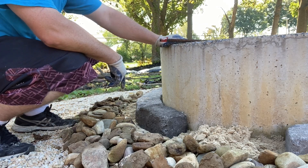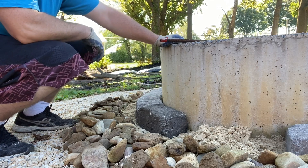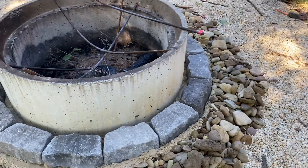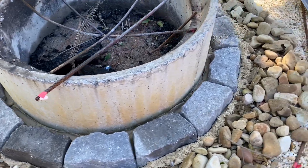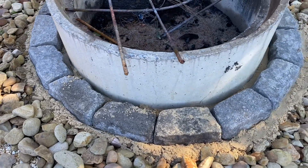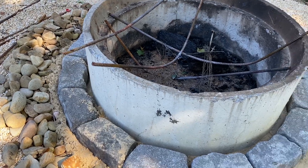Let me go ahead and finish this row and then we'll start on the second course. Everything is nice and level. You can also measure from the top block up to the rim just to make sure you're even all the way around — if you followed your reference line in the first course, you should be fine already, but it never hurts to double-check. First course is all done. When I initially measured, I needed a little more space, so I just moved the block slightly away from the concrete and it allowed everything to fit in perfectly without any cuts. Pulling the brick away from the wall just a little bit still keeps it structurally sound.